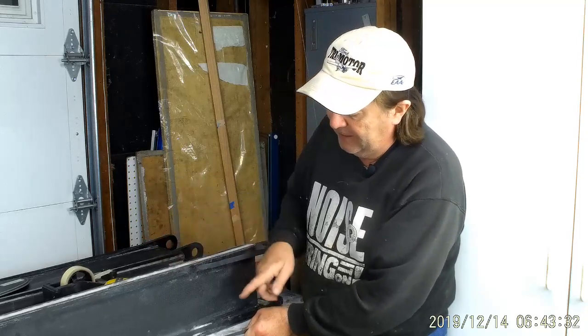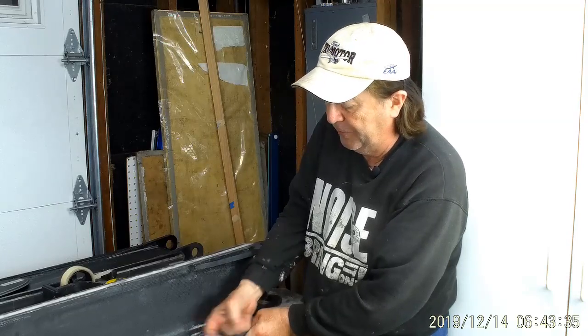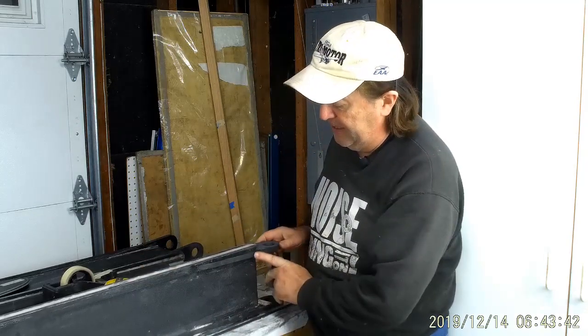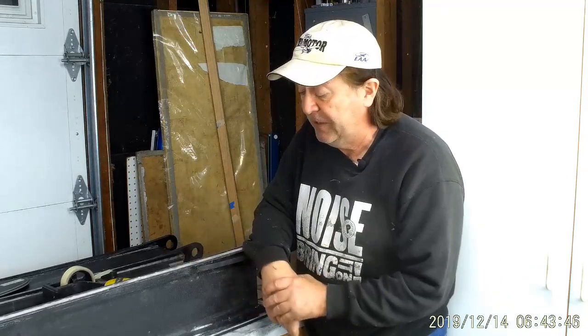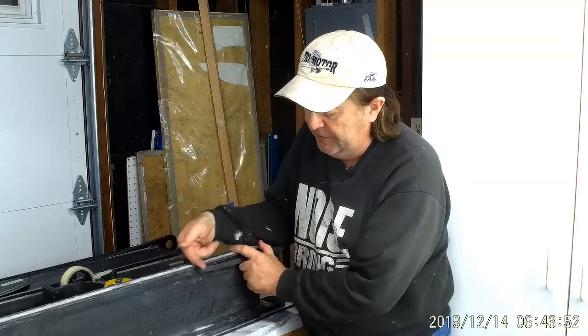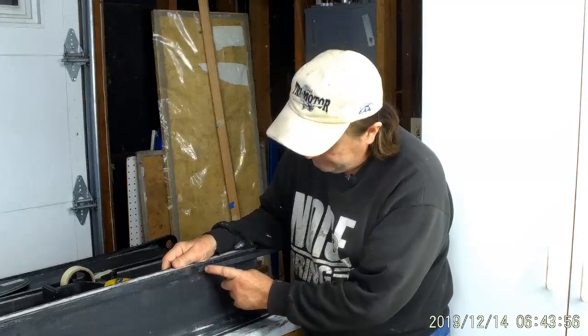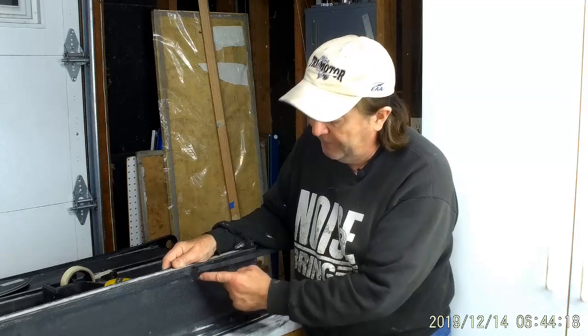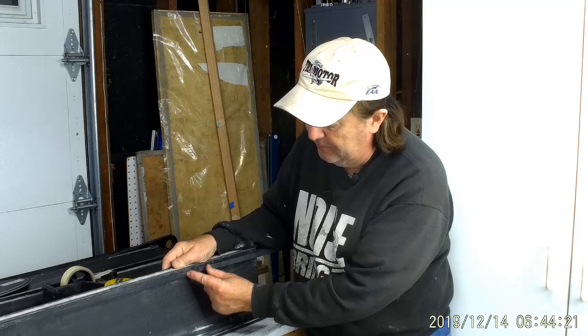Now this epoxy is good for 7,000 psi in tension. So then we have to find out, well, what is the tension load that's on here, the perpendicular coming away from the shear web trying to straighten this out? I've made that calculation. This is about a 5-degree angle here. And if we take the maximum load times the sine of 5 degrees, it turns out it's about 2,850 pounds. So over a ton of force going this way, trying to lift up that strap. However, if we look at this area of concern here, it's about 1 square inch. And the epoxy is good to 7,000 psi. It'll take about 3,500 pounds of load, this area here. So almost double what the load is here.